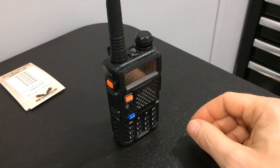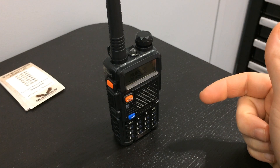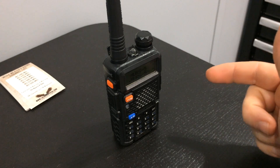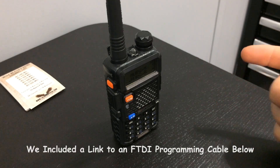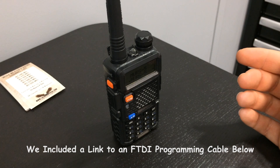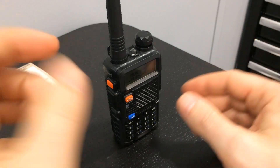Let's touch that in two areas. You talked about the programming cable first, and that's actually a really important thing. If you're going to program these, they come with a programming cable — a Chinese cable — and it's hit or miss on whether or not it's going to work. Many people have spent more hours than the money they would have spent on Amazon buying a new cable trying to figure it out. So on the cable, plan on investing in a new cable that has the FTDI chipset. Search 'Baofeng UV-5R FTDI cable' and find a bunch of them on Amazon — they usually run around 20 to 24 bucks. It'll save you that amount of money and time.